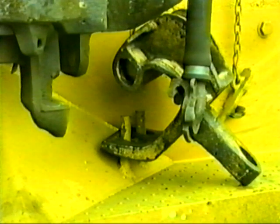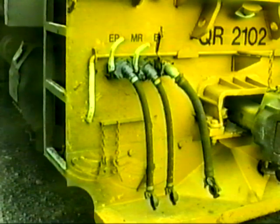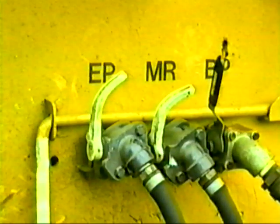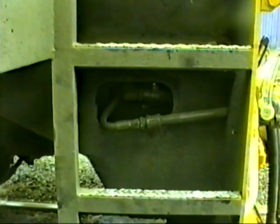The securing bracket for the ball hook when not in use. There are three air coupling hoses: EP, MR, and BP. The EP and MR pipes are blinded off with only the brake pipe connecting through. These pipes are blinded off at this point behind the headstock.